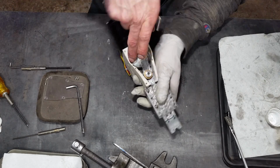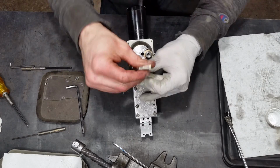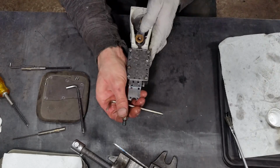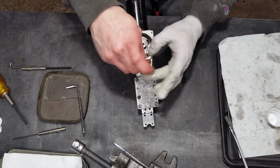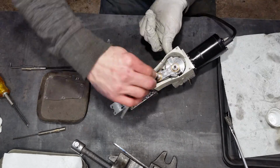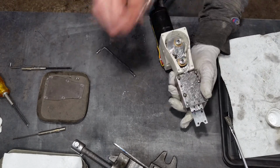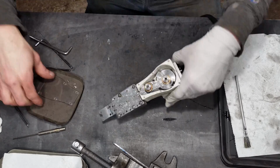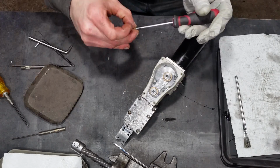Now, taking off that connecting rod made some more problems for me. Part of the problem is that the shoulder bolt that goes into the cam there has a very flat bottom because there's not a lot of threads there, and so on and so forth. It has no taper in order to engage, so if I put the other side in first and then try to engage that one, it will not go in. So eventually I figure that out, and I reverse the order that I'm installing them in, and I'm able to get the whole thing to go back into place nicely.